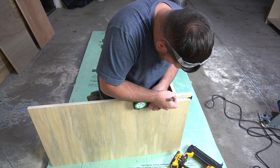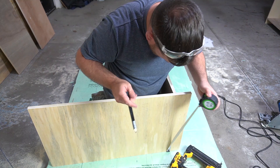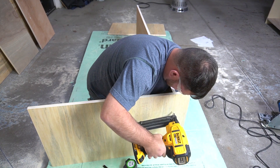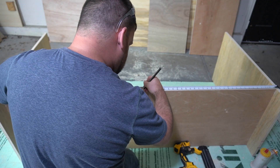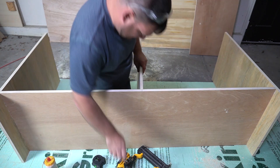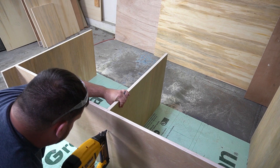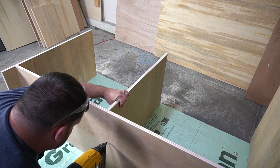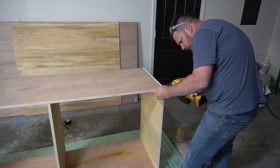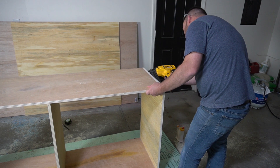The assembly process went really quickly with this construction method. Glue and brad nails is not the way that everybody would build it, but it's a sufficient way for this — these things were rock solid once I put all the pieces together. Another reason I went with brad nails and glue is just for accessibility; I wanted to show how you can build something with really just a nail gun and glue. The one downside to using brads is having to mark where you're going to shoot them through, because I missed sometimes and had to pull them out and redo it. This process was basically just following my Fusion 360 model and assembling the pieces I had already cut to size.